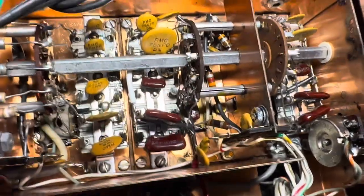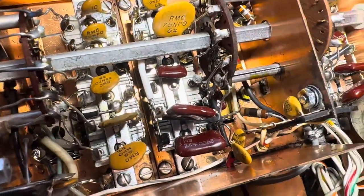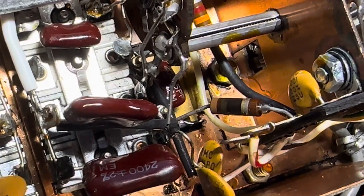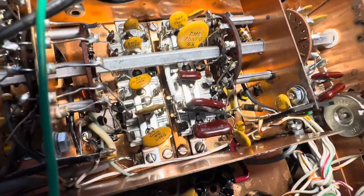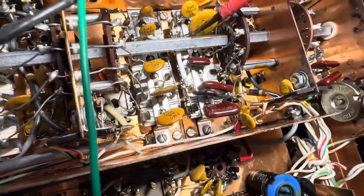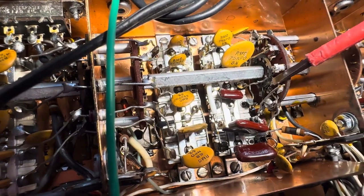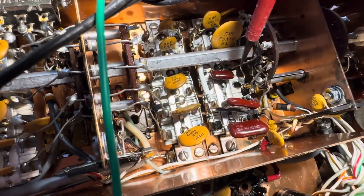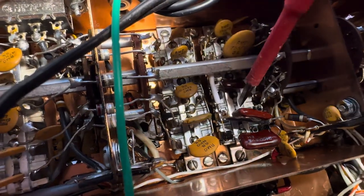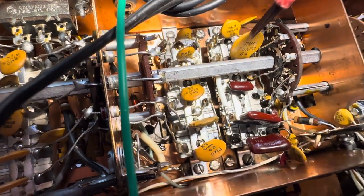That short could be what overheated it a long time ago. There's a resistor that feeds B+ and it's pretty much smoked — I need to replace it, but I simply disconnected it as a bush fix to find the short. In this section, the 40-meter capacitor is shorted — it smokes when B+ is applied. I simply jumped it out. You can see the loose wire for the 40 meter, and I cut it off at the bottom row and ran a white jumper wire, basically shorting out the 40 meters.